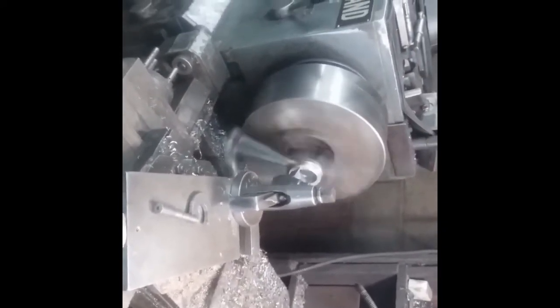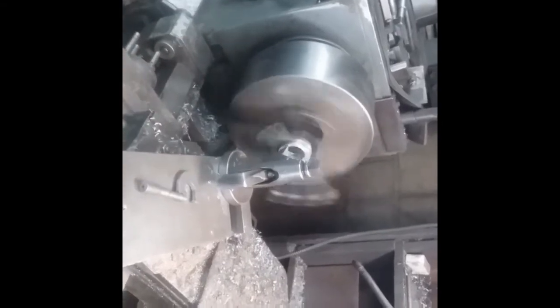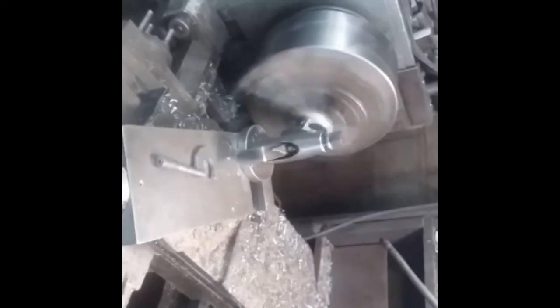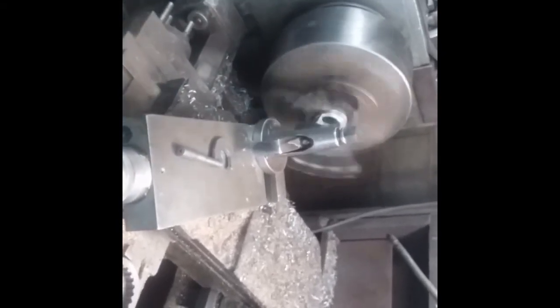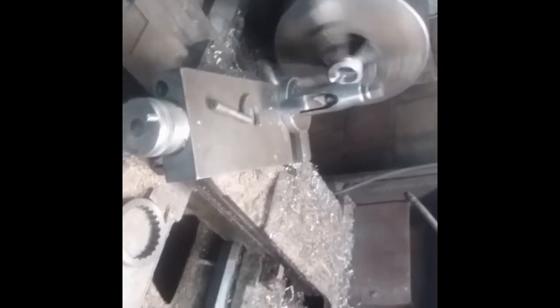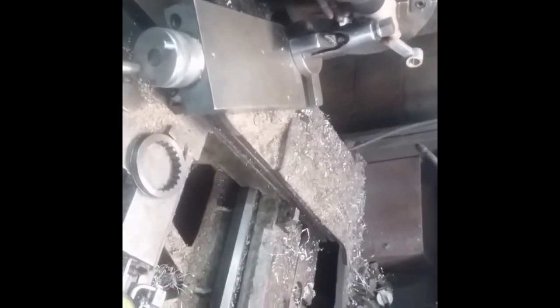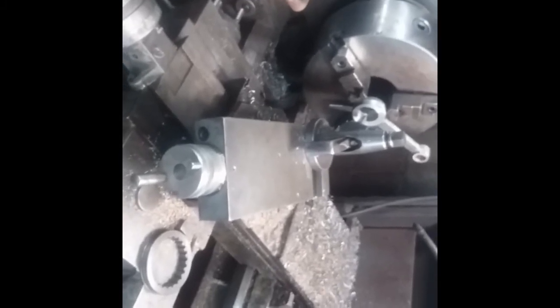Now, do these rods press apart, or do they go together like keyed? No, this slips onto the machine shaft that is oil bathed. And that goes on the crankshaft, that end. So you have the shaft, you have the bearing, which is just a piece of machine steel. And then you put these two rods on, they're already up in the cylinder, and then you have a flat plate that goes on to keep these from falling off the end of the crank.